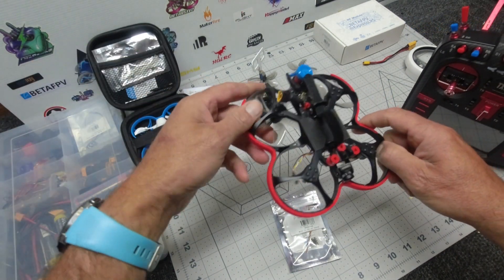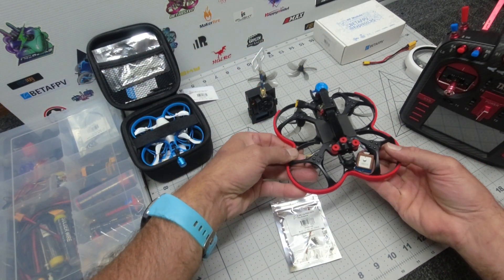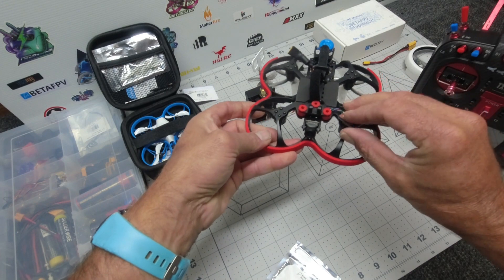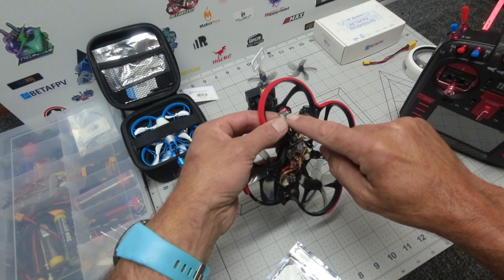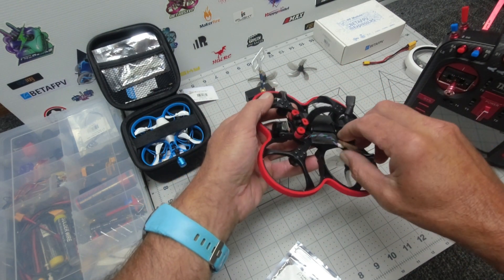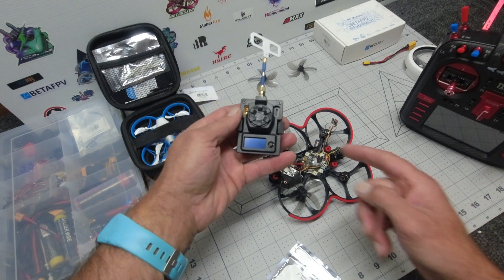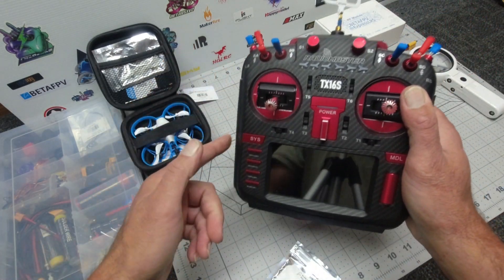So what we're going to do is install it into the 95X and we're going to do a range test. To do a range test we need something to measure range. So I have been installing an M8 GPS which I'm going to sit on top of one of these motors here, so we can get a true range test and see how far this little tiny flat antenna receiver will take us before we fail safe. Let's install the GPS, put our receiver on, and then we're going to go in the field and fly it with our 1 watt ELRS 2.4 gig transmitter attached to our Radiomaster.